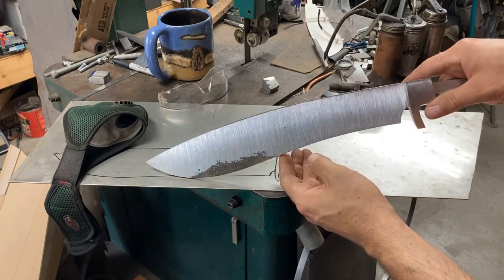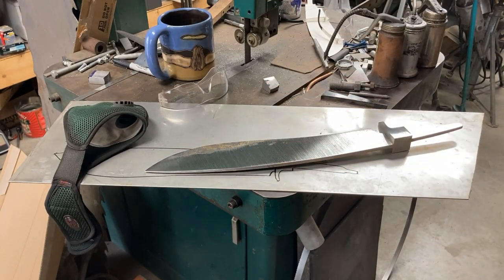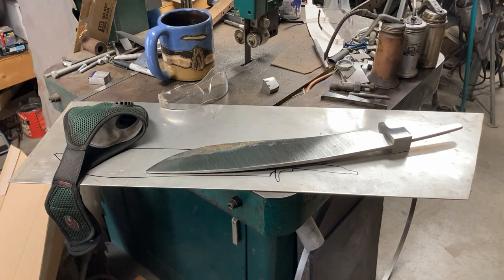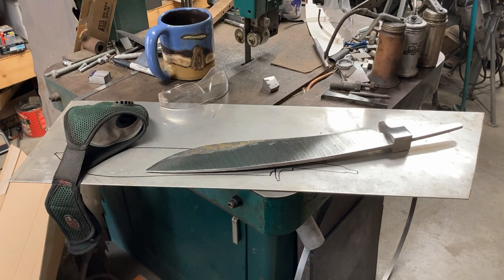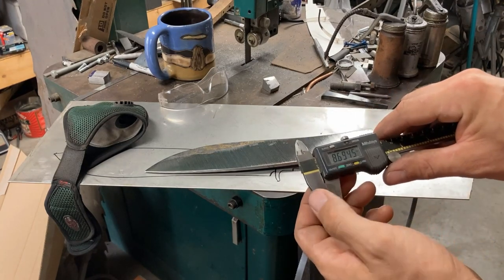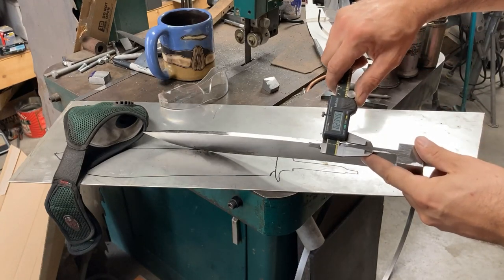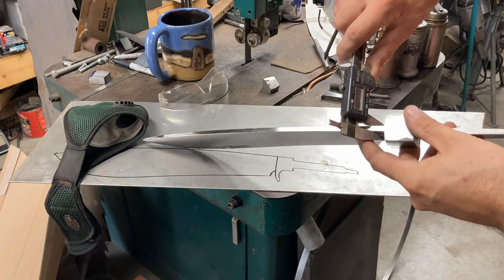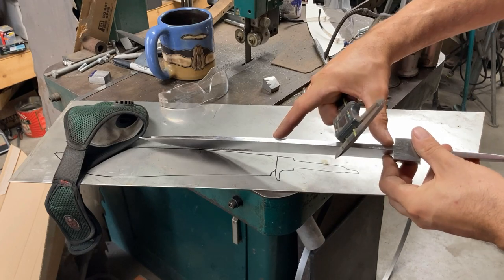It'll be a little bit wider here because we forged it out, but it will gradually get wider and gradually get smaller and I think the effect will still be quite acceptable. So right now let me get something a little bit more sophisticated to measure with. Okay, digital calipers — turn them bad boys on, close the jaws, zero them out. Let's have a look at what kind of thickness we got. Okay, 235.